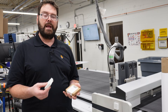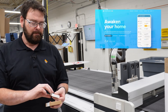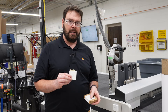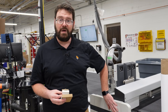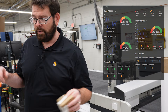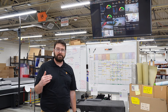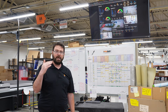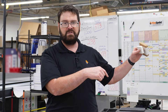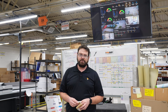Then what do we do with the sensor data? We use a free tool called Home Assistant — it's a software, and if you're into smart home automation, you know exactly what it is. We wrote some basic code, which ChatGPT can help you write — we'll put a link in the description. We track OEE over a period of time, and one of the most valuable metrics we show the guys at the shop is the two-hour rolling OEE. When they come in in the morning it'll be at zero, then as they ramp up they watch that OEE climb. It helps incentivize the team to keep equipment running — opportunities like asking a coworker to keep it running while you grab something really do help drive that OEE up.